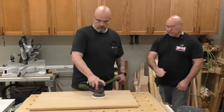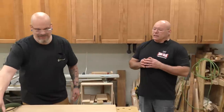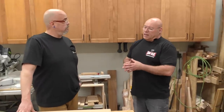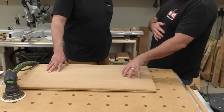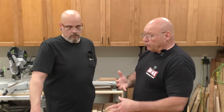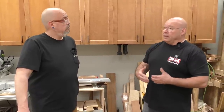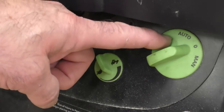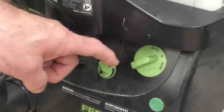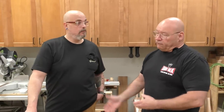There are some times you'll get swirl marks another way. It's great to have a dust extractor hooked up to your sander - that way you're sanding the product or your board, not more sawdust. And that's always a great tip. But what I like is to hook it up to a dust extractor that has variable suction. Why variable suction? When you're sanding, you're going to notice it's pulling down too much. So the variable suction is right here - we have it with an auto start, it automatically comes on. You'll feel we break the surface tension so it's pulling less into the material, and it's really good when you're sanding finish.